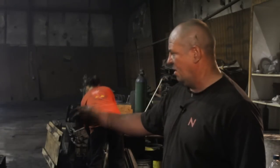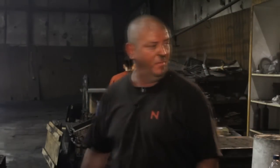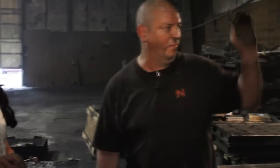I'm Morris. I've been doing this for 30 years. After we get done pouring, it takes about 15 to 20 minutes for the metal to cool enough that we can start shaking it out. We'll take the clamps all off, clean the metal off the tops of them, haul them out to the other shop, roll them out, shake the boxes out, let them sit for a few minutes to cool, and they'll go over to the cutoff wheel from there.